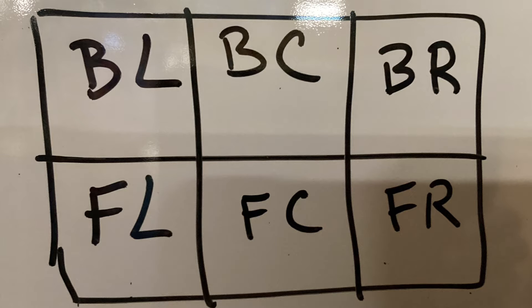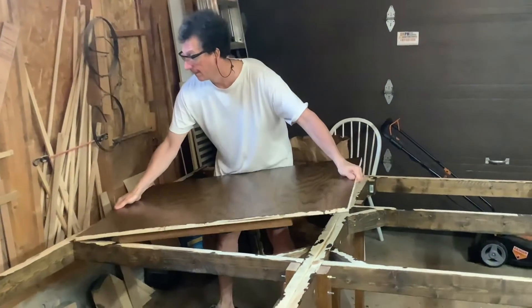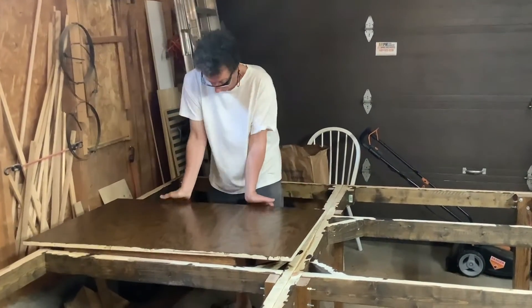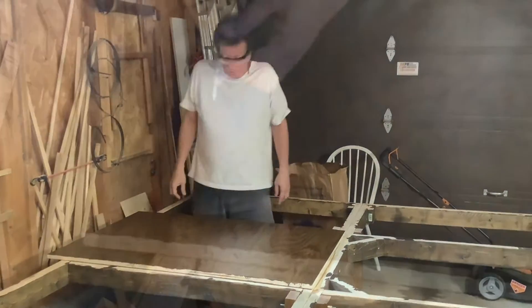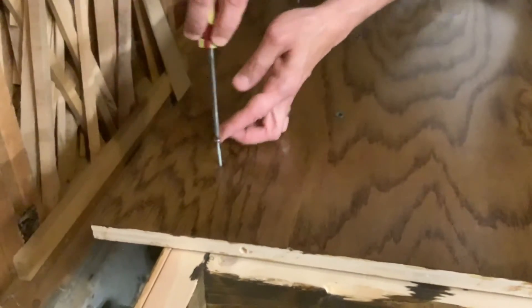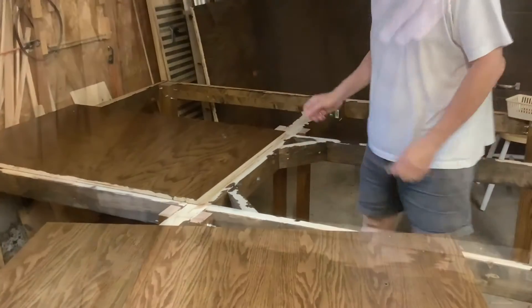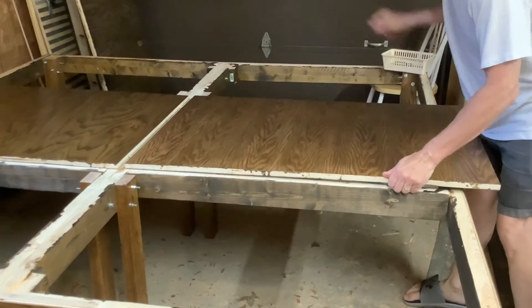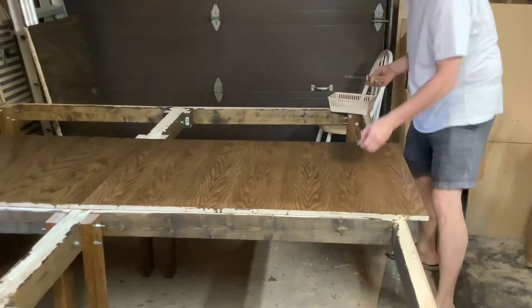Next are the panels. Here's how they're labeled and organized. We're going to start with the back center — it's the easy one to find. It's got cleats just to try to keep it straight and the other pieces aligned, so it might require a little bit of light taps to get it seated. Underneath you can put some of the cleats in; there are screws through the cleats into the frame. On the outer edge there are just a couple of screw holes that should go really easily by hand. Next, put a couple dowels in and put the front center panel on — line up the dowel holes, push it in, and put the screws into it.